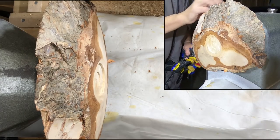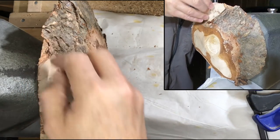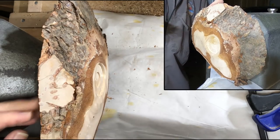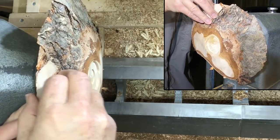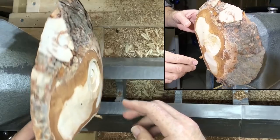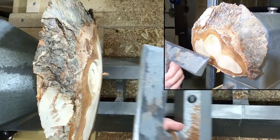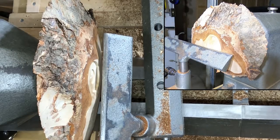I'm going to take these clamps off now — let's see how this worked out. The bottle says 10 to 25 seconds; I've left it for about three minutes. I can see where I didn't get the glue in close enough to the surface at the top of the bark, so I'm going to do a little bit more. It looks like the glue is holding fairly decently. I'm sure a lot of this bark is not going to survive the ride, especially this big chunk up here, but there's just one way to find out. 1000 RPM again, three-eighths inch bowl gouge.